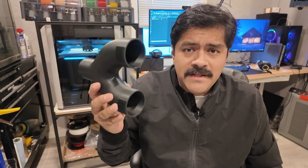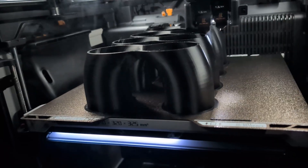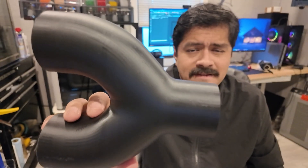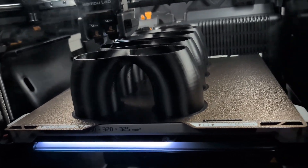Now let's talk about printing performance. This is PLA — these are wire splitters that I designed for a rigid interface. It actually performed pretty well. I printed four of these on the same bed and it championed through with no problem. The finishing at 0.2 millimeters of layer height is actually not too bad. Printing four of them with no issues is pretty astonishing as well.